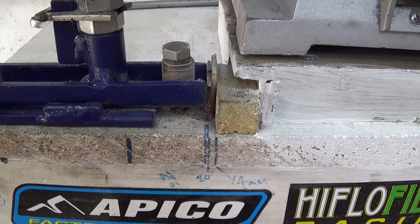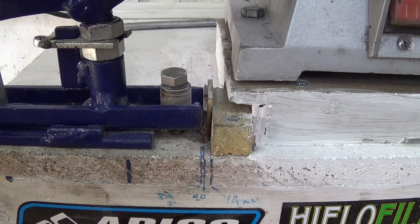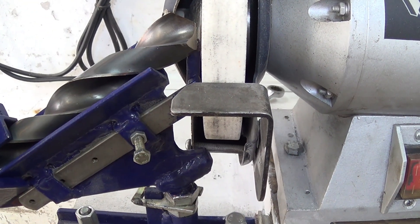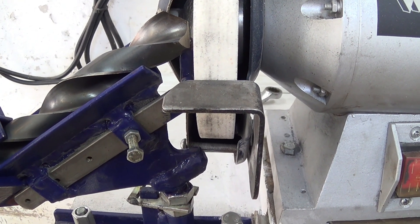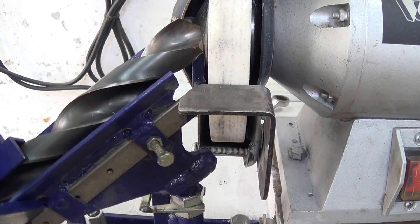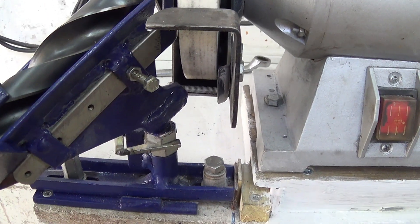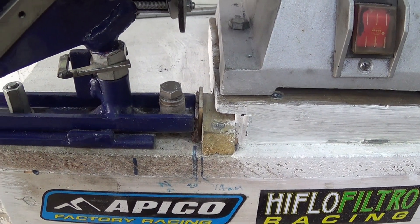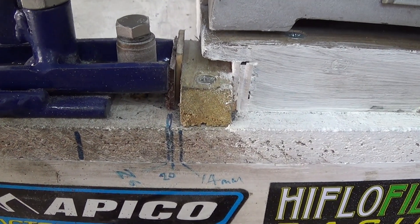The other thing that needs to be adjusted for the size of the drill is the radius of this arc. It's a bit hard to explain, but the smaller the diameter of the drill, the tighter the curve it has to follow as it follows the face of the drill — the cut face of the drill. I tried to work out what that should be mathematically, couldn't get anywhere at all with it, so in the end I did it by trial and error.